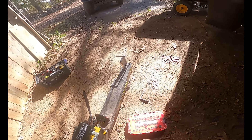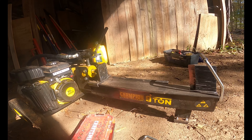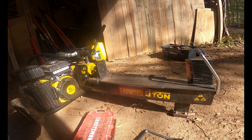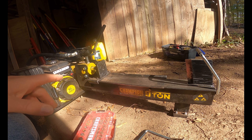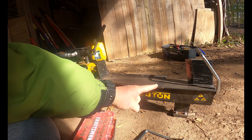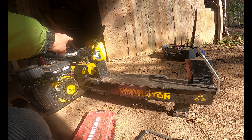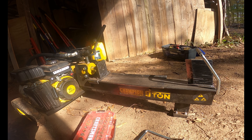It's important to keep that fine-tuned. For how to get air out: number one, on the splitter itself, you have to make sure that you push this all the way forward. We're going to crank it up, extend this plunger out all the way, then cut it off, and then rock the handle back, which should release any air that is caught in the hydraulic lines.